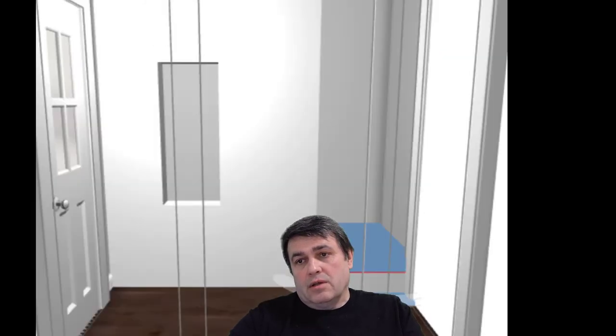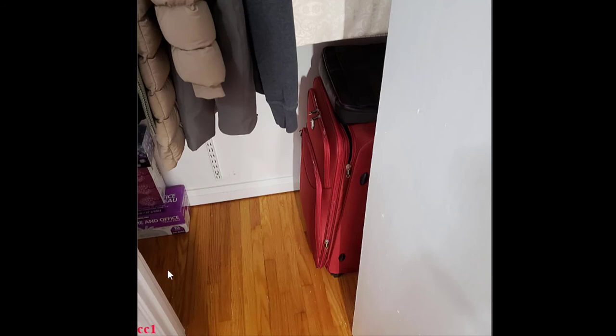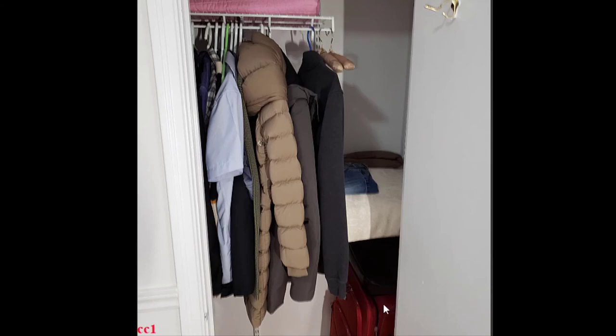This is how it looks. Here is not an opening — it's just a regular door which I'm going to replace. This is the entrance door, and here is the hallway. In front of me I have an opening to the family room. Now let's get into the detail of the build. My old closet door was 24 by 80 inches — I had to get rid of it completely. Inside it was 24 inches deep and 48 inches wide, which is not enough to provide a toilet and even a small vanity.